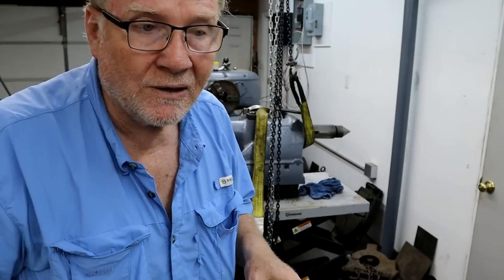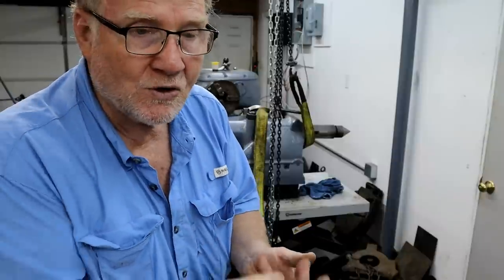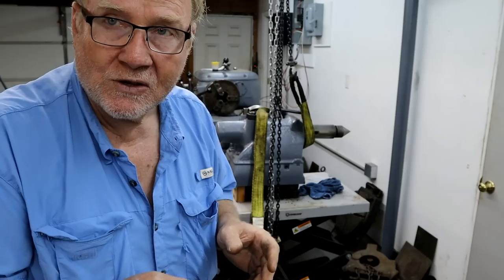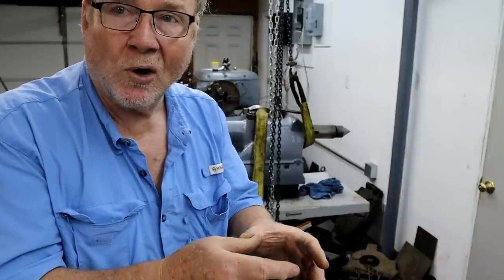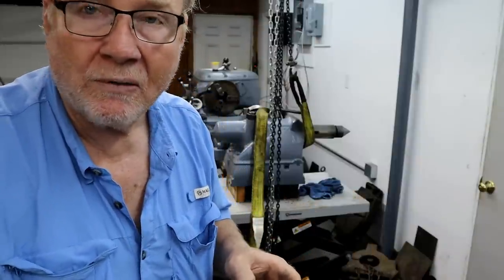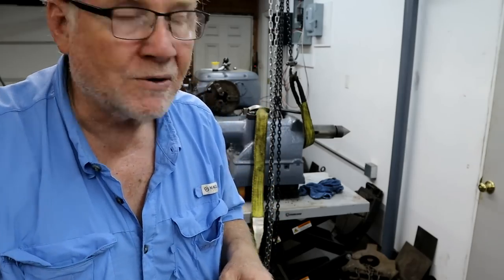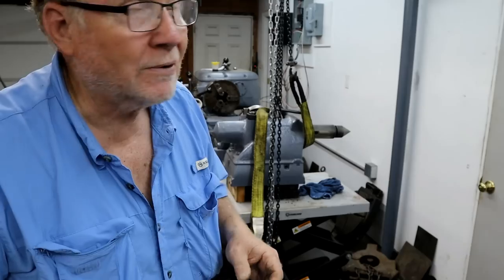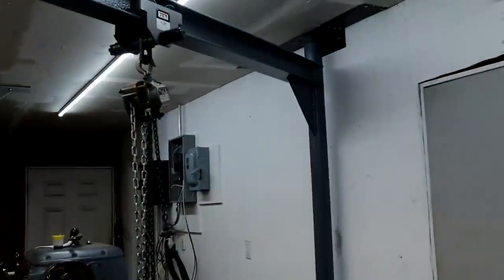this guy came up with the idea of using a trailer hitch ball, a 2 5/16 ball, mounted on a steel plate on the ground to insert into the socket that you make for the inside of that pipe. You're going to need a lathe to make one, but you make that insert, put it inside a piece of 4-inch pipe, and it sets on top of that ball. And you put a lot of grease in there. When I made the insert, I bored a hole going up and packed that full of grease. It should grease forever.